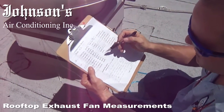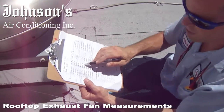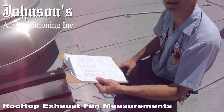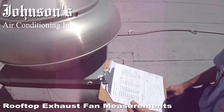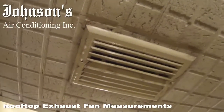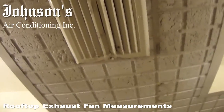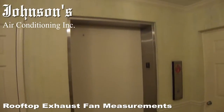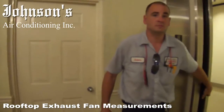There was one of them that I actually was able to turn on but left off because the fan blade is very wobbly and the fan is making a loud noise and I don't want to upset anyone in the residence. The building is at a negative pressure, the diffusers are sweating, and the infiltration is coming through the elevator — going down.